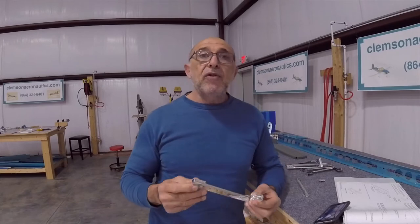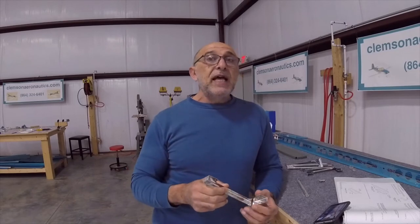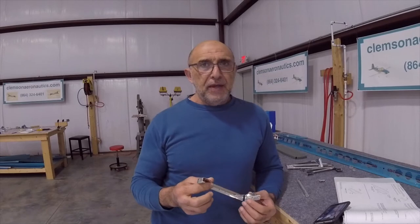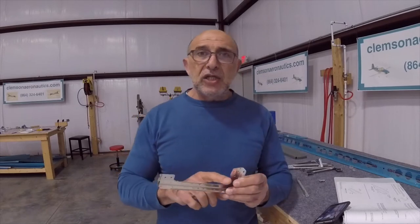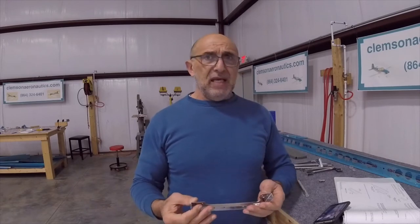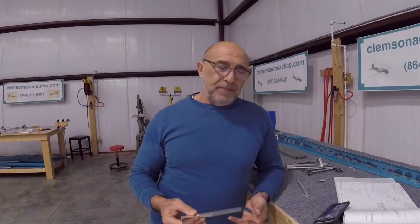It can be very easy if you're very careful. Don't put too much pressure. Also, when you're using the buffing wheel and you feel the part heating up, you don't want that to happen. You want it to barely touch. Heating up the part takes the hardness out of it — you don't want that. So be extra careful when using the buffing wheel with these parts.